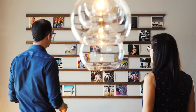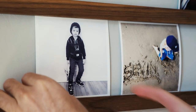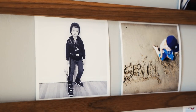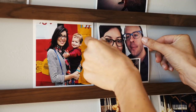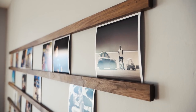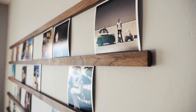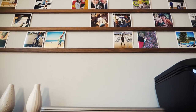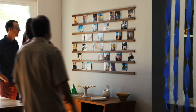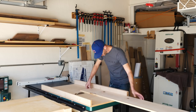The first thing I wanted to change was the wood species — I wanted to use something with a little less contrast against the wall. Now if you want to build this and you don't have a planer and a jointer, you're going to want to look for S3S or S4S lumber. That just means the wood has already been surfaced on both faces and at least one edge. You can find some species, usually poplar and oak, at the big box stores, but for fancier species, try looking for a local hardwood retailer or search online for a company that can deliver. The wood isn't cheap, but you don't need much for this project.